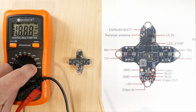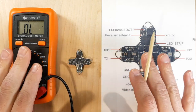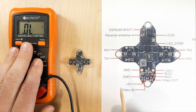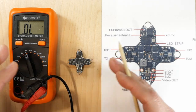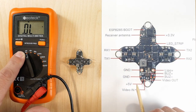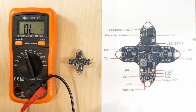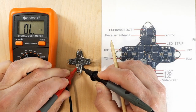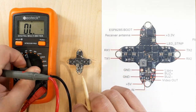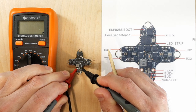I love this meter for the channel because it's very inexpensive — only about $20 on Amazon. I have no affiliate or Patreon at this point, so I still recommend it because a lot of people can't afford a several-hundred-dollar meter and still fly quadcopters. We'll set our meter to continuity. I'm going to go between our LiPo positive and ground. I heard an initial beep when I touched the probes, which tells me this board has a fair amount of capacitance.